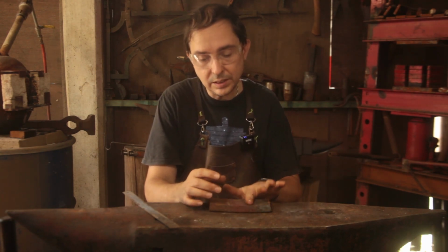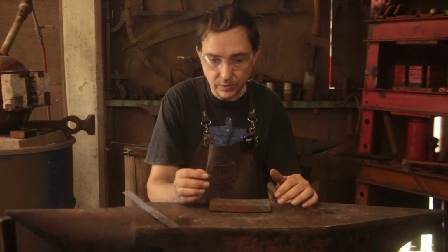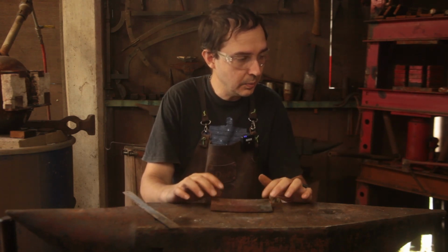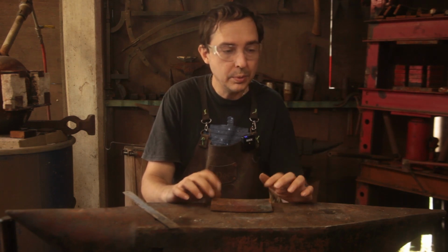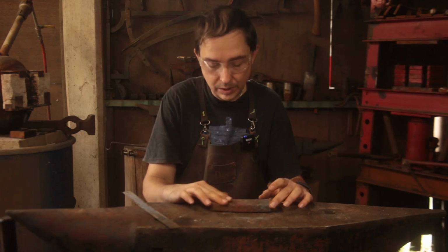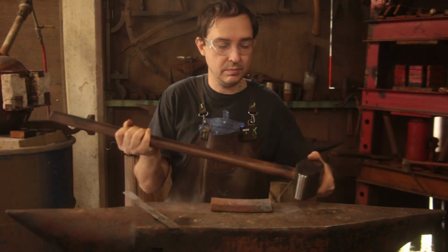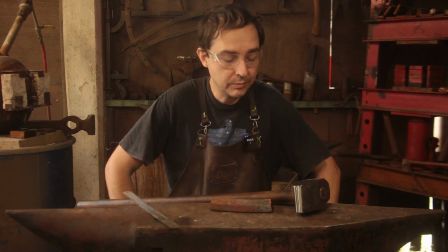I'll see about welding on a piece of steel to the outside of the pole to give a harder working surface. It'll be an asymmetrically wrapped die. And then I need to find a little bit of something that I can taco up a bit of tool steel for the edge and then weld that into this body. And as I said, all of that is so that we can try out our new hammer from Seth Woods